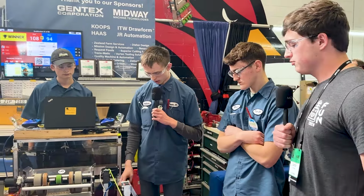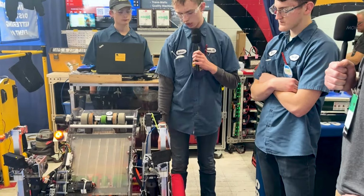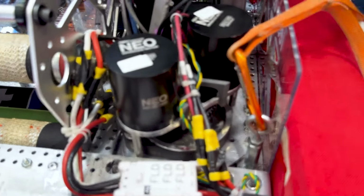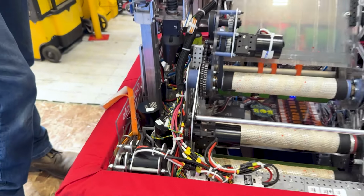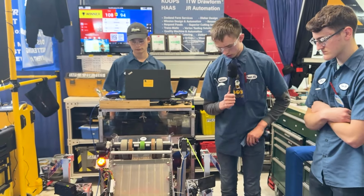We are running just a generic swerve drive from Swerve Drive Specialties. This year we moved from an L1 gear ratio to an L3 to get more speed. We also offset them from the side, as Josh said before, just to get that booster bar, as much intake as we can. There isn't a whole lot more to it.